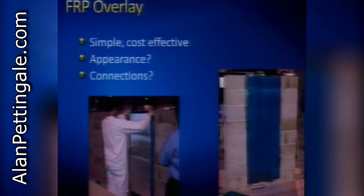Fiber-reinforced polymers as an overlay to strengthen masonry are becoming more common - the American Concrete Institute has published design guides on this. However, I don't see many applications for historic construction because this system involves epoxy coating and adhering fiberglass or carbon fibers to the face of the wall using an epoxy matrix. The appearance is not what you want with historic masonry. But there are situations, such as basement walls and other interior applications where appearance isn't a primary consideration, where it may be feasible.